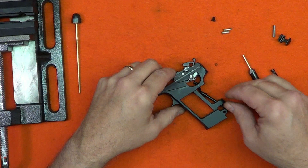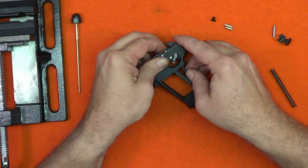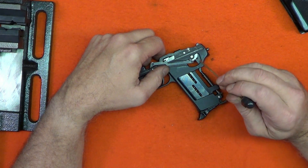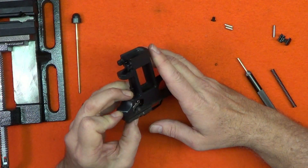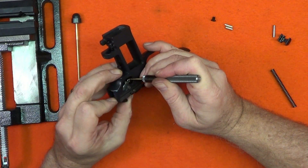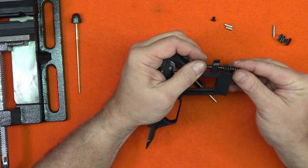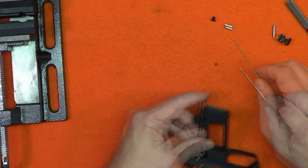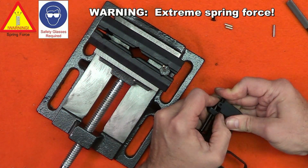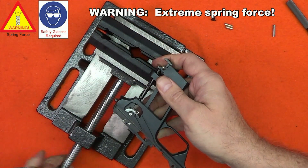To install the spring rod, the hammer has to start in the cocked position. To cock the hammer, press down the disconnector and then pull the hammer back. Place the spring rod so the notch on the top engages the crossbar inside the hammer. Then, while keeping the spring rod engaged with the hammer, move the hammer forward by compressing the disconnector, disengaging the sear with a punch, and then pulling the hammer forward in that order. Install the mainspring. Installing the magazine catch pin requires a lot of effort — it is handy to use a third-hand device like a tapered follower placed in a vise. Compress the mainspring with the magazine catch and drop it into the follower. Now use the magazine catch pin to press out and replace the follower.